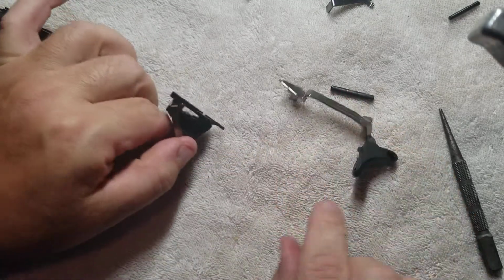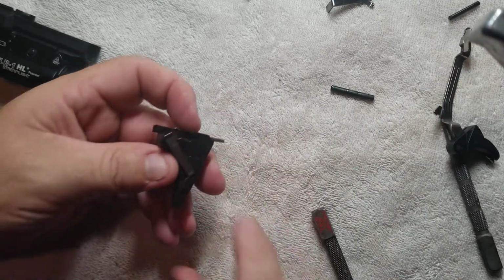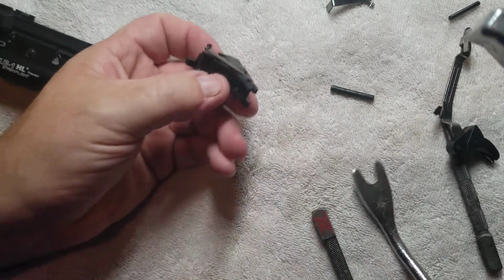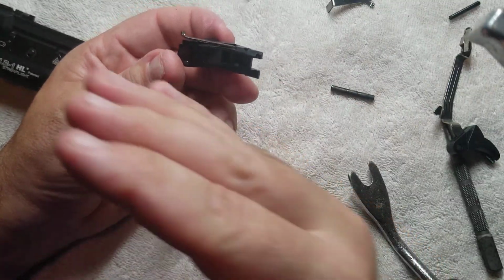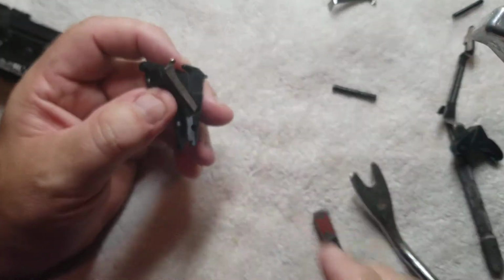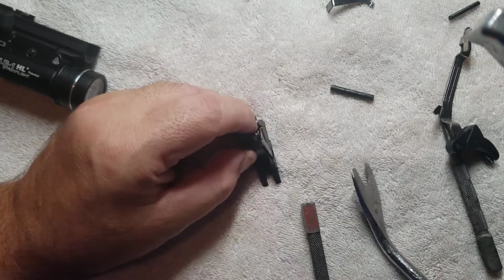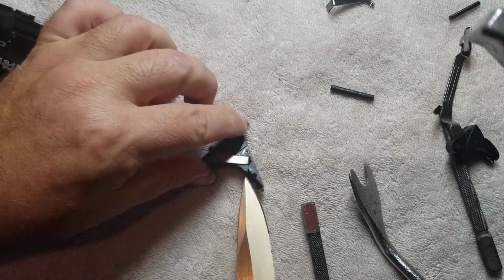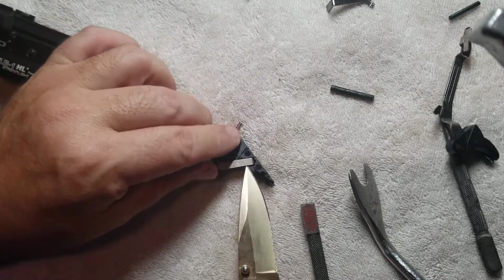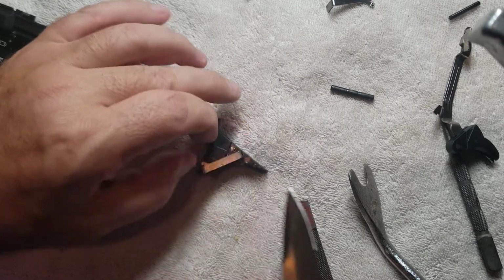So we're going to take a look at an unpolished disconnector, and you can see that it's not flush. It kind of angles out. What I mean is that bar doesn't lay flat against it, it angles out a little bit. Use this real quick. Basically, you go to the base of it and you just pry it out.